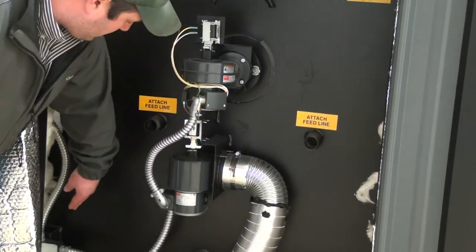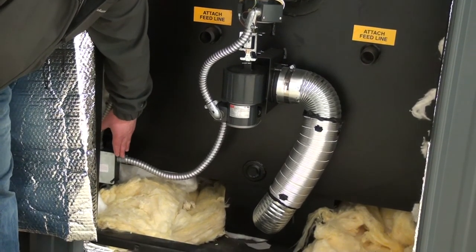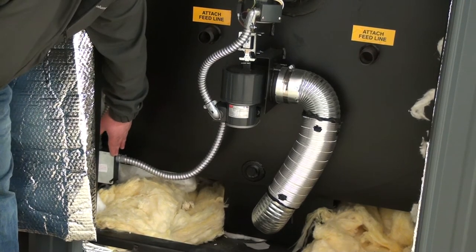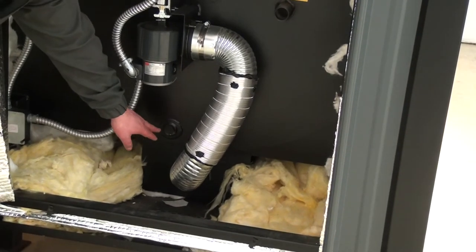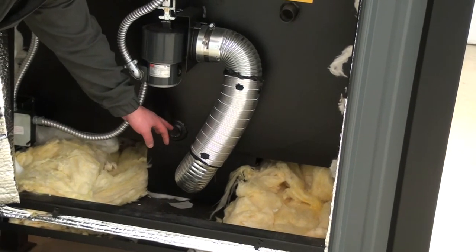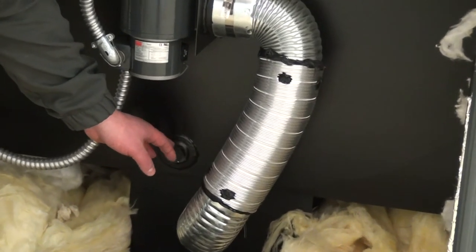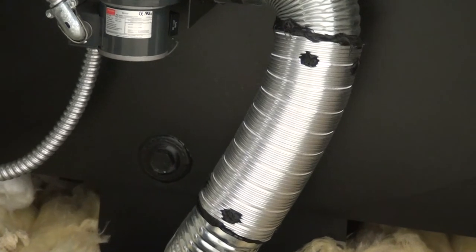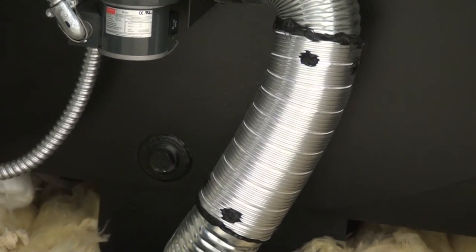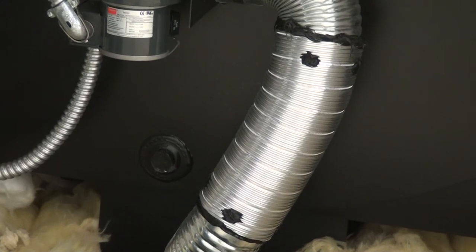You've got your electrical components back here — we can put an outlet and a switch to turn your pumps on and off. In the center bottom of the stove we also have a boiler drain where you can install a ball valve to fit a hose on it. So if you ever want to drain the system water — say you're leaving on vacation and won't be running it in the winter — you can go ahead and drain the water and blow the system out.